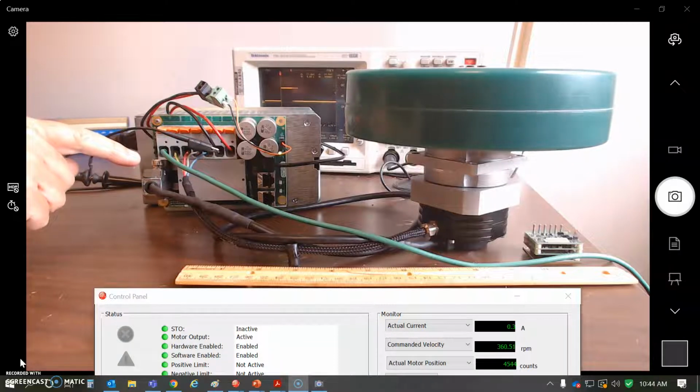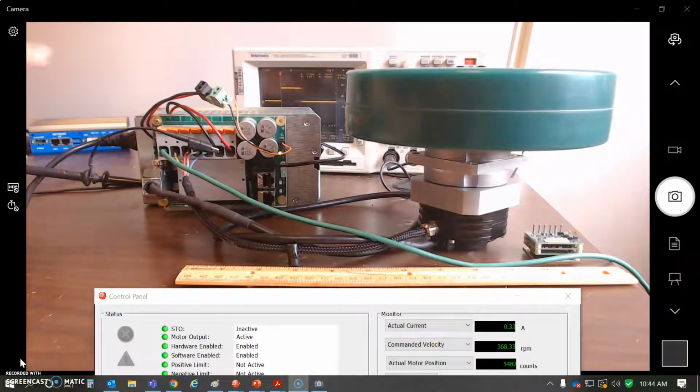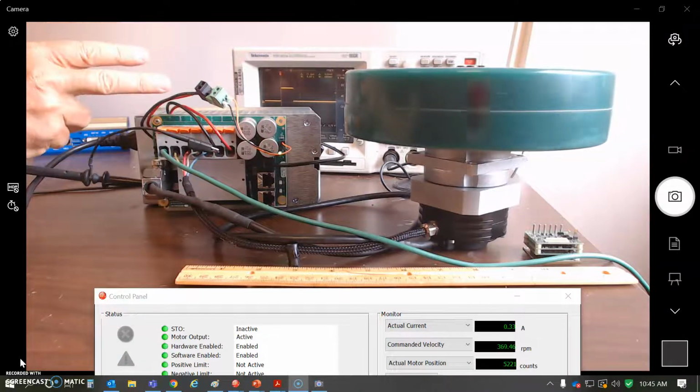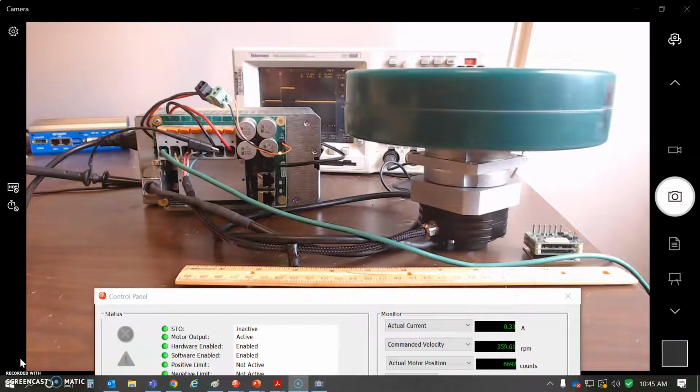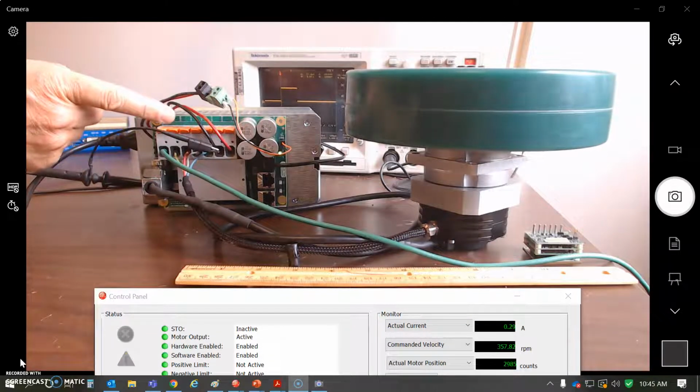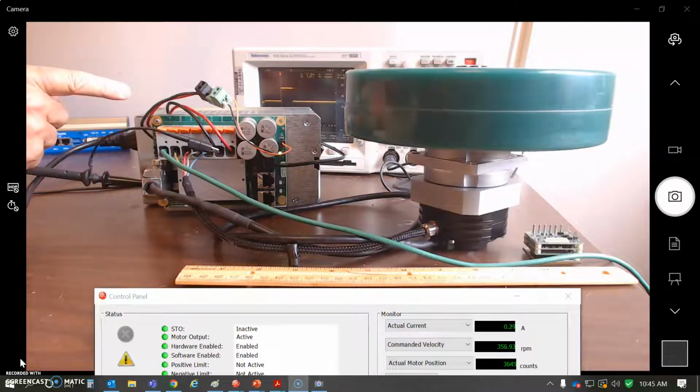This AEV or APV module is plugged into a development board, and I've got this riding on the back of an XP power supply. It's a dual power supply, 48 volts for power. Maybe it's only a 5 amp supply. Typically the AGV will have a battery system, so maybe you don't have to worry so much about current limits on a power supply. But there's also a 24 volt supply in here for keep alive, or if there's brakes or whatever auxiliary stuff you have. You could also run the V-logic off of the 48 volts. Just make sure you don't regen up past 65 volts.